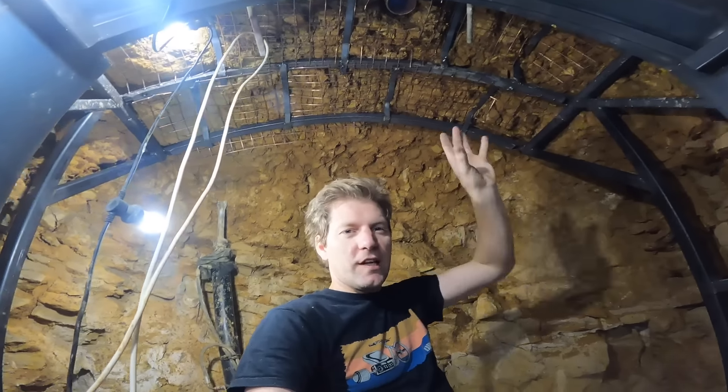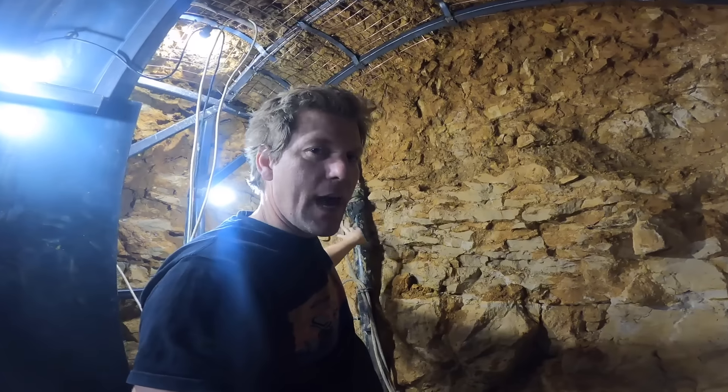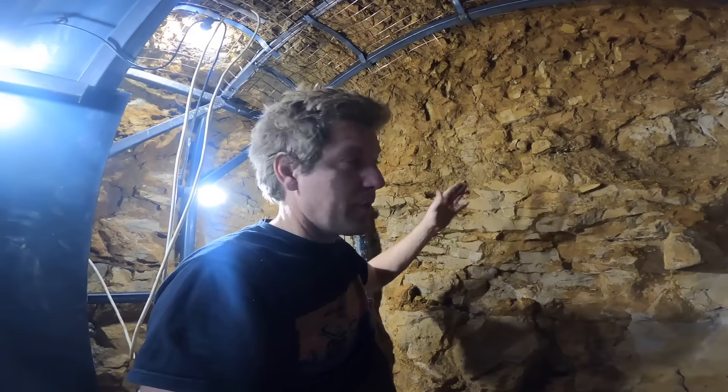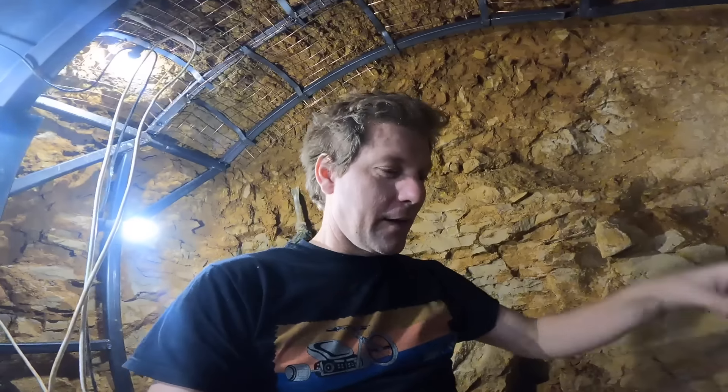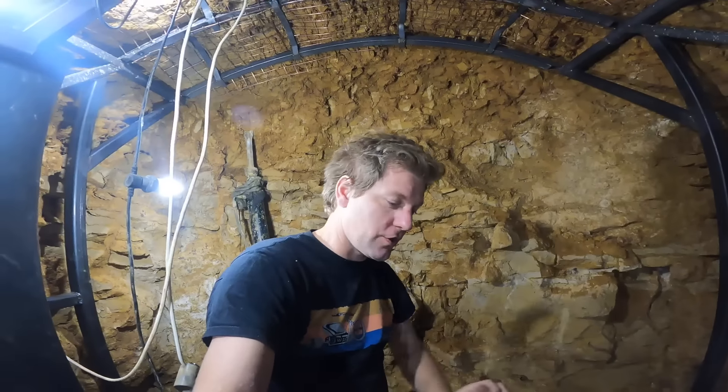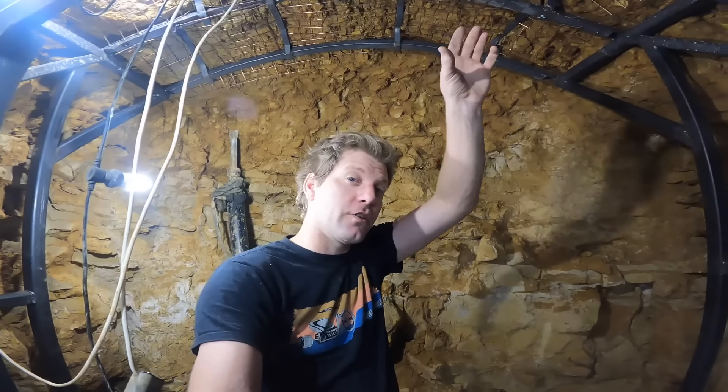Got our ceiling supported. Now we need to find out exactly where we are before we start turning left to go into the house. We need to know when to turn left, and also the centre of that piece of tunnel, so when we come up under the house it's in the right place. What we're going to do is drop a bit of box section down, clamp another bit of box section to the side of it down here and at the top, so it mirrors the straight line. If we lay it in a straight line down here it should be in a straight line up there. Then we can see exactly where we are, where we go in, how far across, up, down - whatever we need.